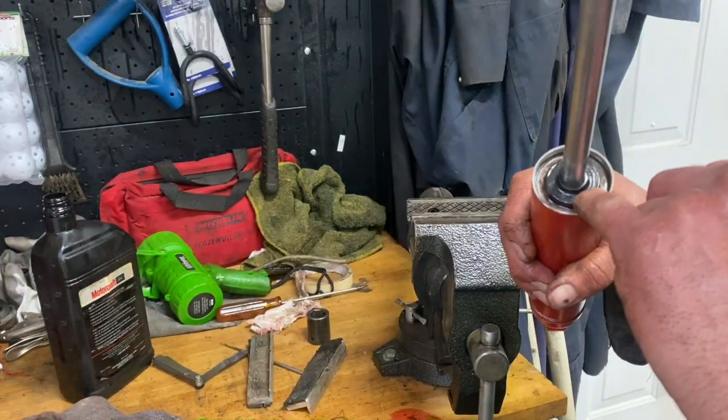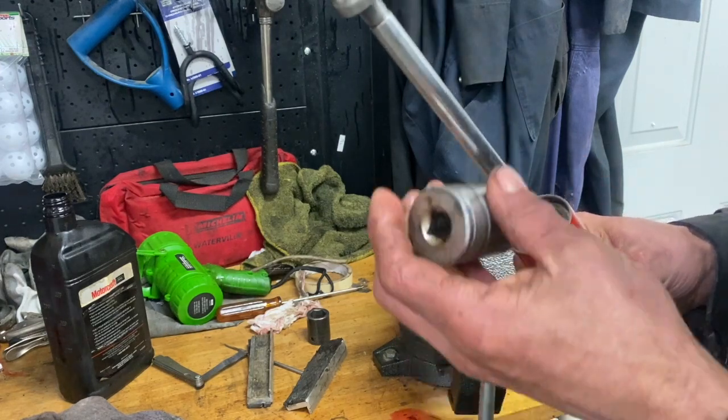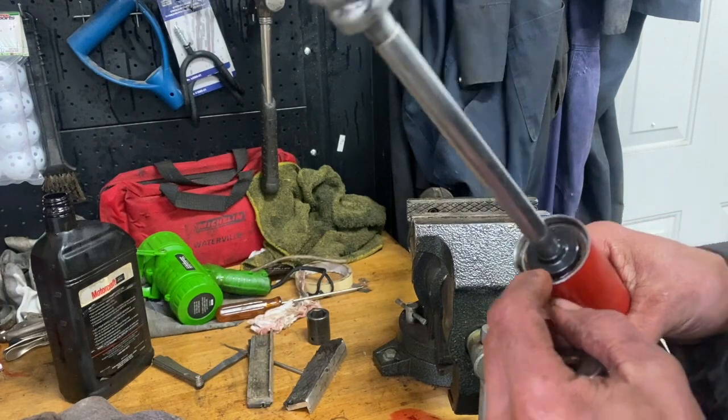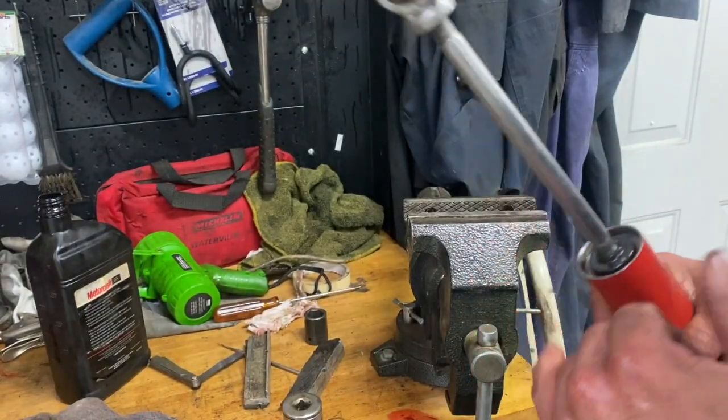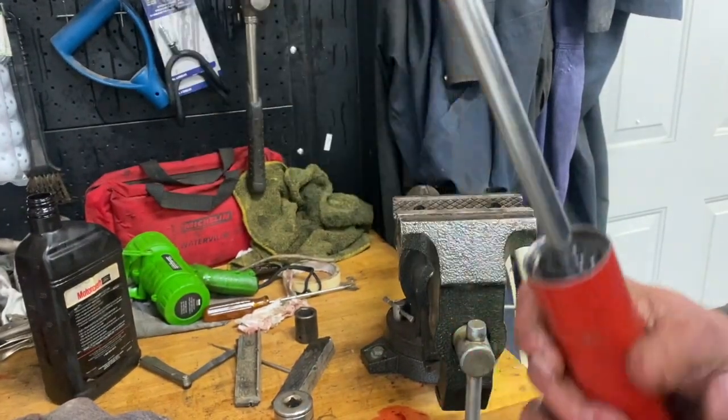I'm going to put the ring in the groove inside here. When you tap in this end piece, don't go too far below the groove. I tapped mine about a millimeter past. Put the ring in, bopped it out — this is now seated against it.